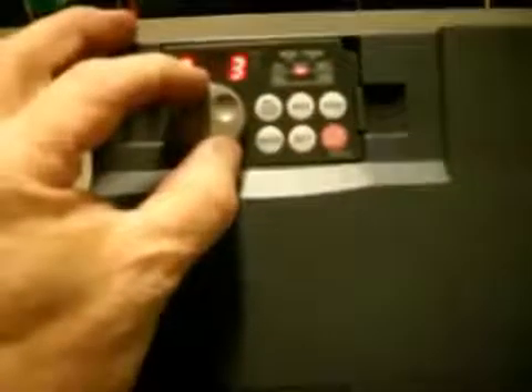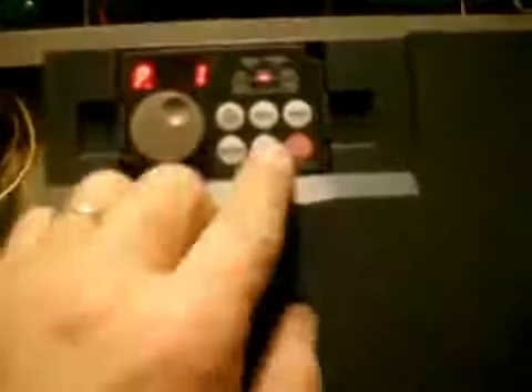This is really easy. You come over to the drive — you can do this while the car is running — and you hit the mode button. The mode button will display the parameter setting, starting at zero. If you want to scroll to individual parameters, you spin the dial, and there are plenty of parameters to read. Once you get to the parameter you want, you press the set button and it'll give you the reading, and you mark that down.